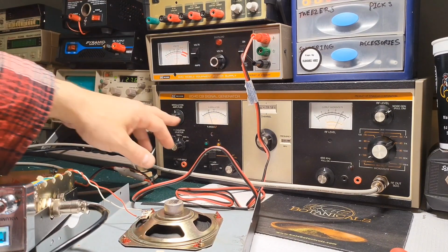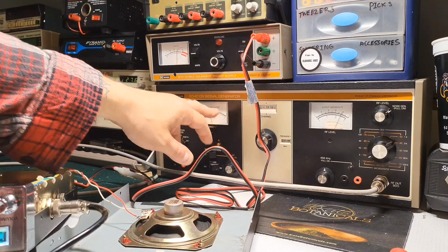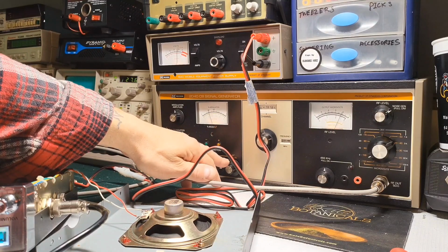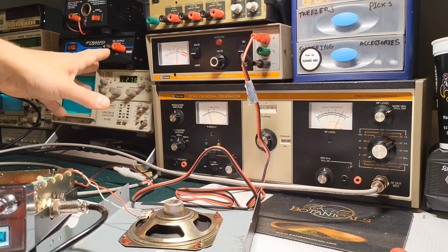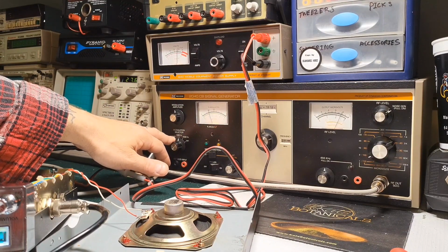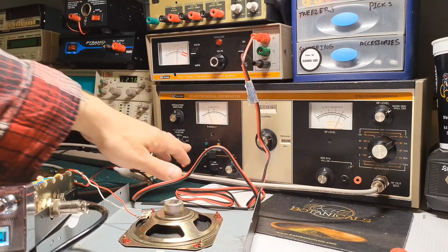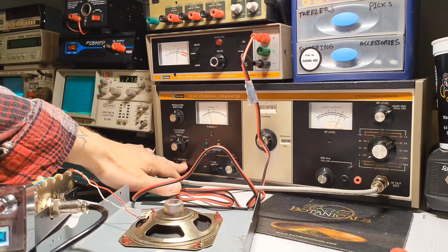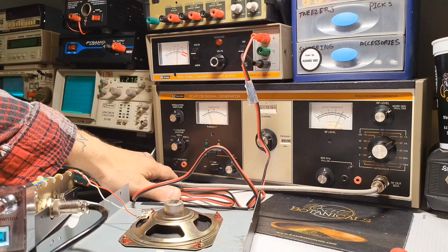But this is the same thing. You can adjust your modulation, 30, 50, 100, whatever. This is the delta frequency, I believe, like a 10 kilohertz slide either way, sideband adjustment. And then you have your selector here for 400 hertz, 1000 hertz, 2500 hertz. And then you can have your exterior modulated tone, and you can input that through this right here. What else?